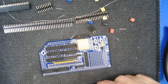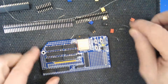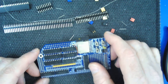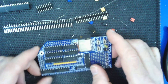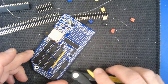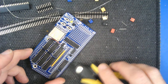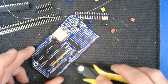If you do get a chip in the wrong place, there are some techniques for removing chips. If you're like me and you think that risking damaging the board is more trouble than it's worth, then you can simply snip the pins on the chip. Obviously this makes the chip useless after that and you'd have to throw it away and buy a new one, but this ensures that you won't damage the board.